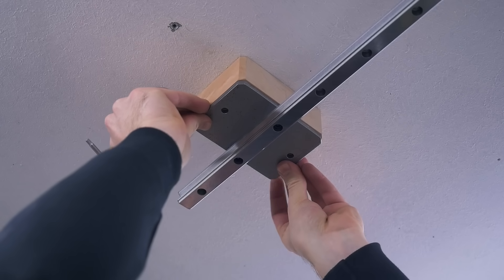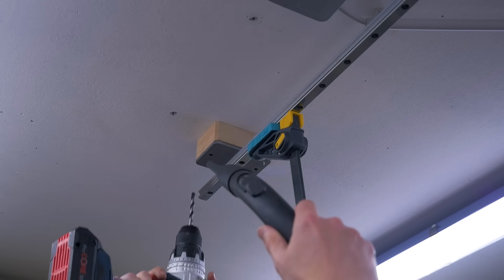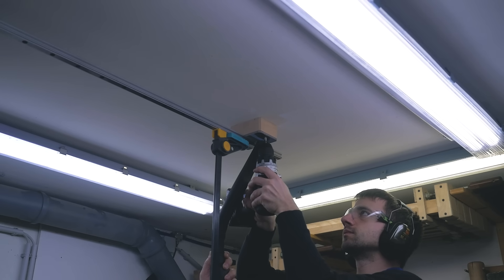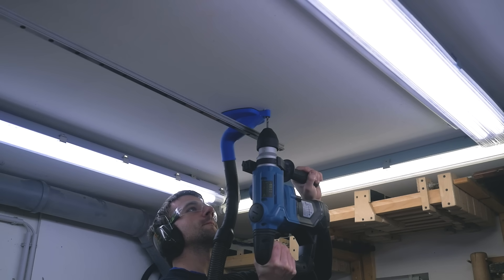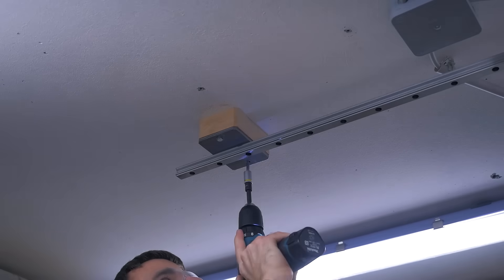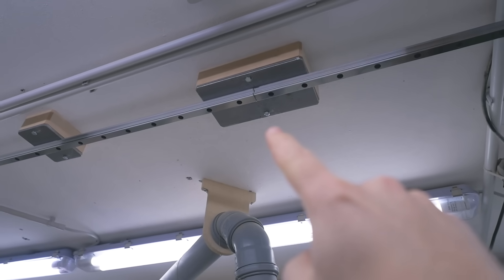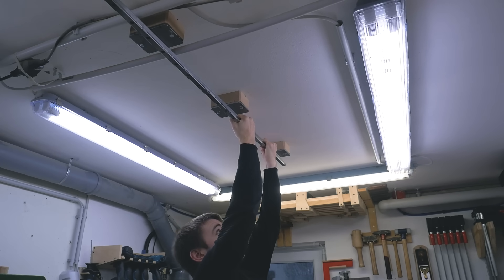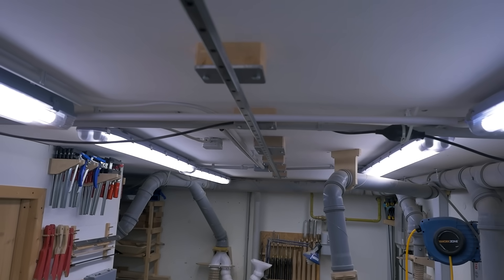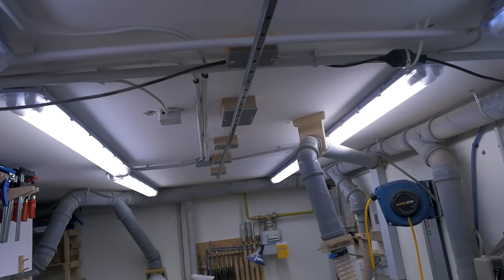Next is securing the ends. We had a nicely questionable clamping setup to press the plate and spacer against the ceiling. It worked perfectly for starting the holes — and here it's essential for the holes not to wander and be at the exact location. In concrete, I found this works best to start the hole with a regular drill, then switch to the hammer function, and then switch to a rotary hammer for the hard work. After securing the ends, we mounted the other steel plates the same way and finally the second center screw. And now this rail is up there for good. Ouch — but also this ceiling is amazingly straight. I didn't have to change any of the spacer blocks, and so the transition in the middle now is basically flawless.